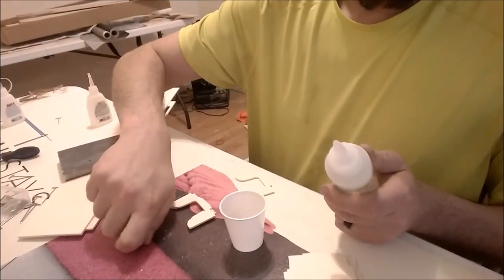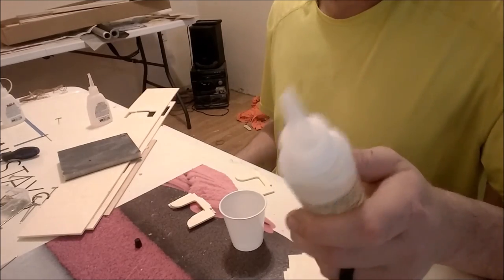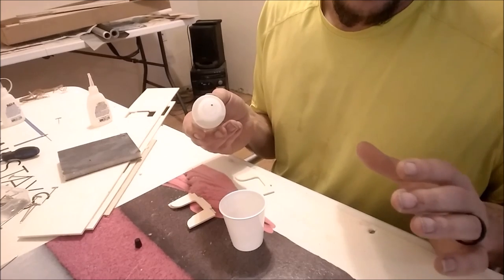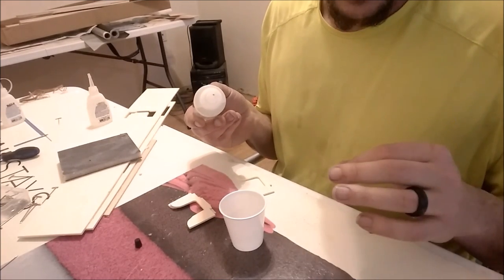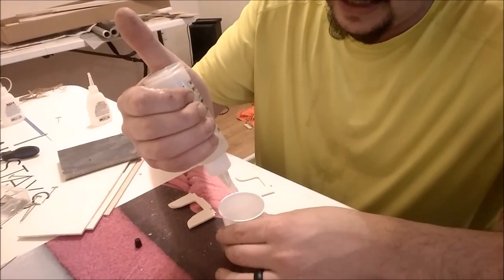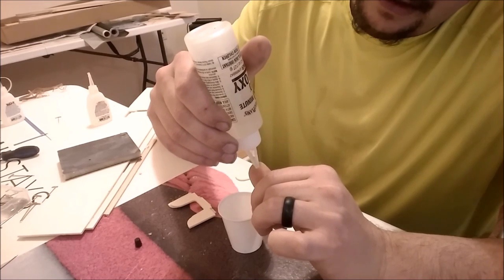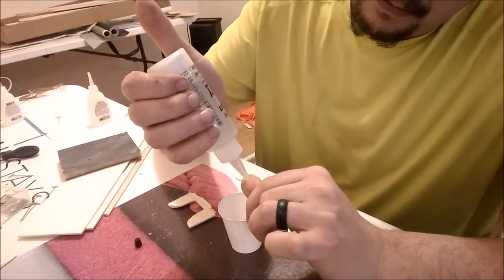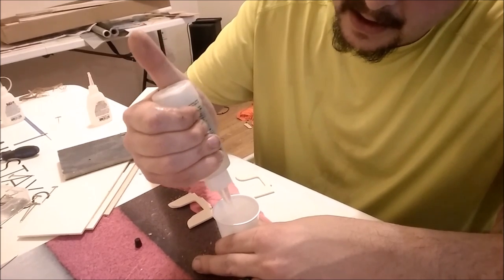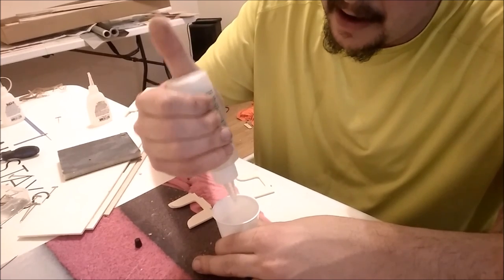Now it's time for our hardener. Again, the same size orifice in the end — you cut that when you get these, so make sure they're the same size whether they're bigger or smaller. Now we're going to count off 15 drops with the hardener. The thing to remember: once we mix this, the clock starts ticking on our 30 minutes. It's a 30-minute set, 24-hour cure. So we've got 30 minutes to do all our work — it shouldn't really take that long. I'm letting gravity do its work here, getting the air out of the nozzle, so we don't get a blast of air while we're counting drops. One, two, three, four, five, six, seven, eight, nine, ten, eleven, twelve, thirteen, fourteen, fifteen.